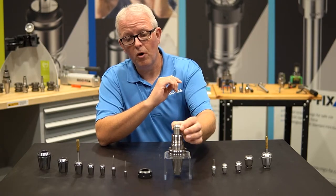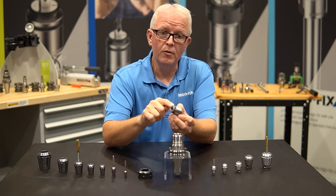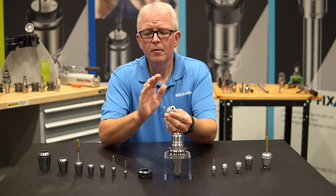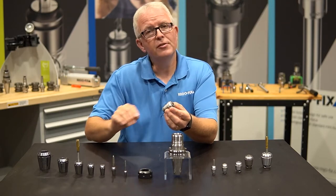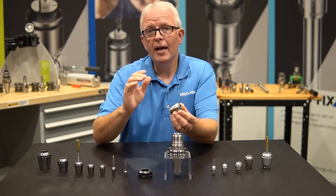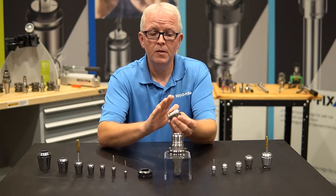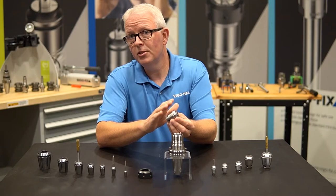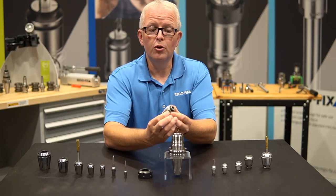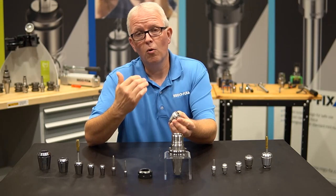These collets will work perfectly fine in any standard ER tool holder. They work by holding onto the square of the tap via set screws, and we do require knowing the diameter of the tap being used on the shank. These aren't quite as straightforward to use as the rigid tapping collets — they do require a little more programming. In standard rigid tapping, you can run a canned cycle, but for the axial compensating collet, you program the machine feed rate behind the thread pitch of the tap being used. That allows you to pull the cushion out during the tapping application and have tension and compression when you reach your turnaround or dwell spot in the tap.